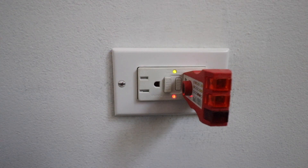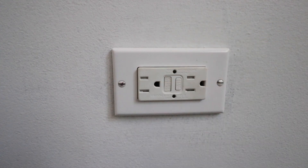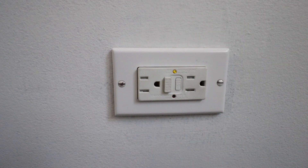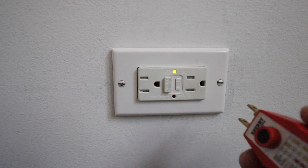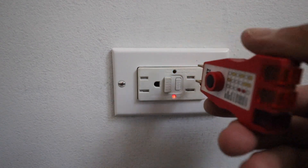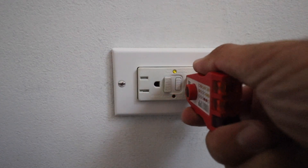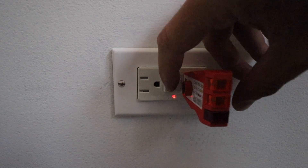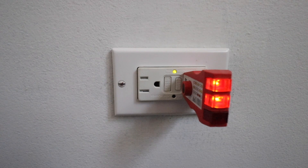You don't have to have one of those testers to test your GFCI. You can also test it just by pressing the reset button, and when it is powered up you press the test button — the reset should pop out and it will cut off power to anything plugged in. A nice feature of this GFCI outlet is that it has those plastic plugs that cover up the holes, making it a little bit safer for children who have a tendency to stick things in there. So go ahead and reset, and you can see that the GFCI is correctly working with no issues.